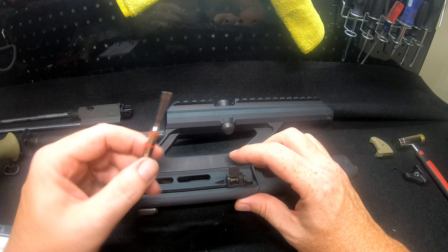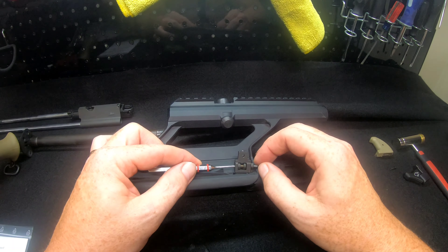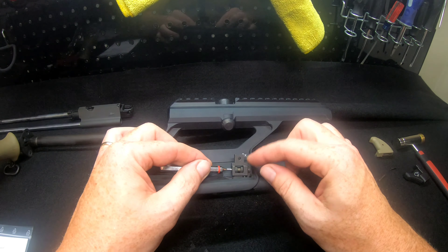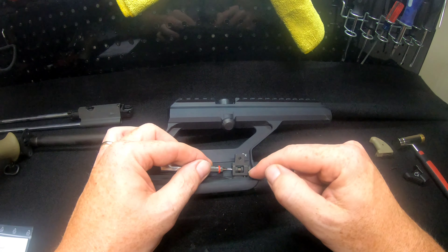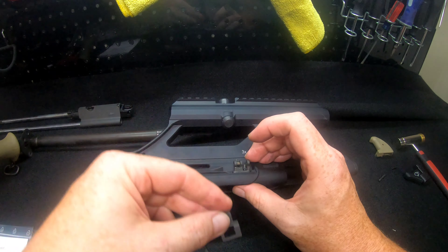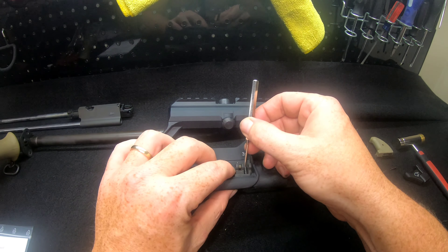Take that 3mm punch and push the link pin from the front to the back. There's this pin right here with the spring — push it through. Now there are two springs in here: one is for the mechanical horizontal movement and then there is a piston spring on the bottom, so do be careful that they don't pop off and you lose them. One fell — it actually has a captured spring.